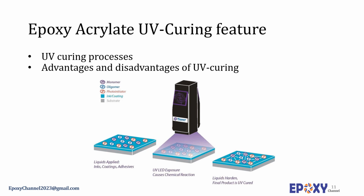In the photopolymerization process, the type of monomer and photoinitiator are of great importance because the compositions can be polymerized using a free radical or cationic photopolymerization mechanism. Currently, free radical photopolymerization is used most often due to the large assortment and low cost of free radical monomers, photoinitiators, and additives to set the final properties, with the possibility of combining them into products with different properties. In turn, the disadvantage of this system is the inhibition of free radical polymerization by oxygen.